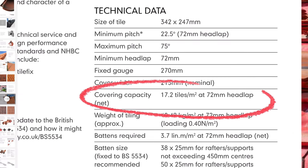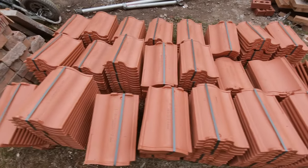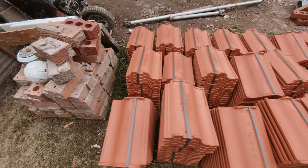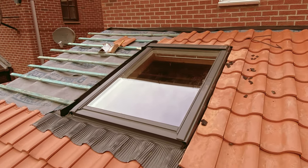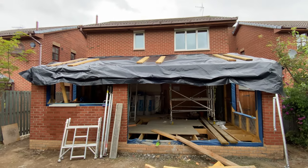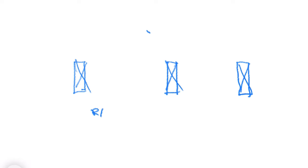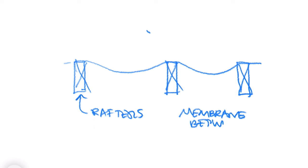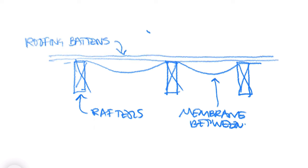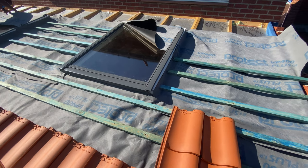Don't make the mistake of using the plan area — you won't have enough tiles as you haven't taken account of the slope. With my area I can then work out the quantity required. I'll allow at least 10 percent for wastage and cutting, more like 15 percent when I'm a beginner. Ordering and laying the tiles themselves is however the easy bit. Before that, we need to fix our underlay or roofing membrane and set out the substrata. You may think that on a roof it's the tiles or slates that are the waterproof bit, but actually they are just in effect a rain screen.